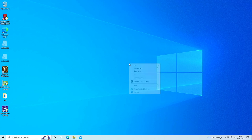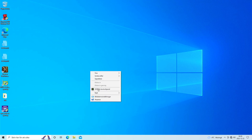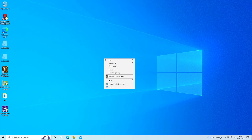Finally, we're back in Windows again with some new drivers installed. Windows decided to do a Windows update when it shut down, and then the Nvidia control panel disappeared, so I had to DDU and then reinstall the drivers again. I tried the drivers without DDU a couple of times before, but I realized some old drivers from when I did the GTX 570 video repair, semi-repair, were still somehow active, even if you select clean install for Nvidia's own drivers. Anyway, I wasted like 2 hours just trying to get Windows to behave with the drivers.